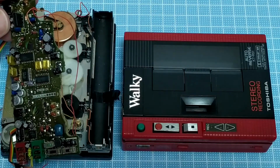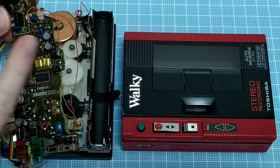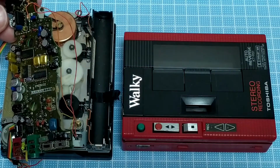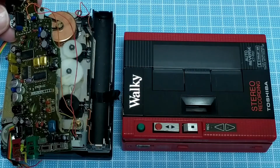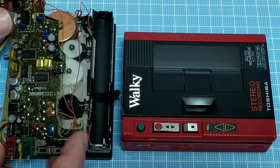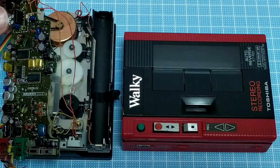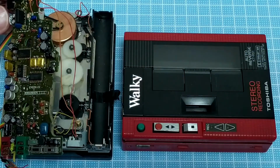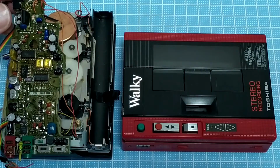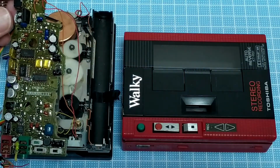And you see almost a replication of some of the circuitry, like the capacitors and everything, and it is basically the same. It's almost a mirror. And there's another chip, and I'm not exactly sure what that's for. I suspect it's maybe for recording or some other system. But some of these chips are labeled with JRC, which is Japan Radio Corporation. They're not easy to find data sheets on. Perhaps not actually sold outside of Japan. I don't exactly know. Or maybe they're made specifically for a company, for a product. So that I'm not sure about.